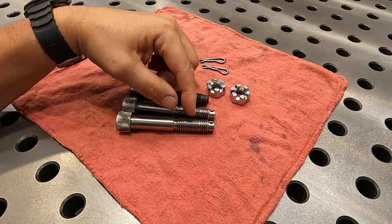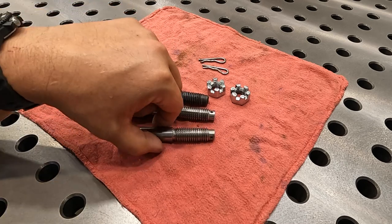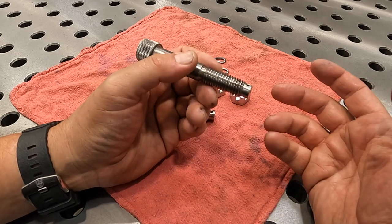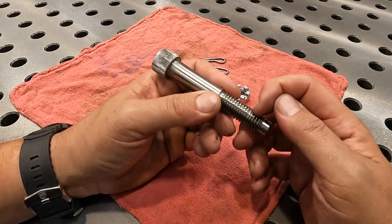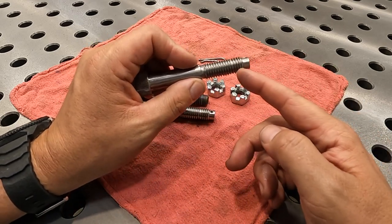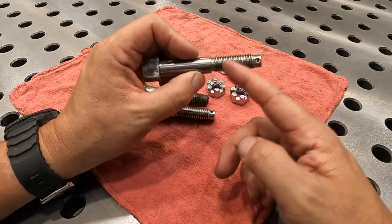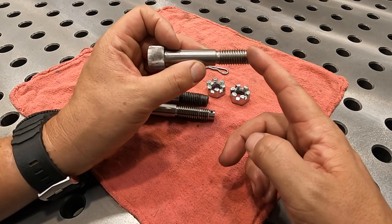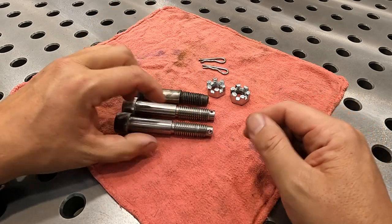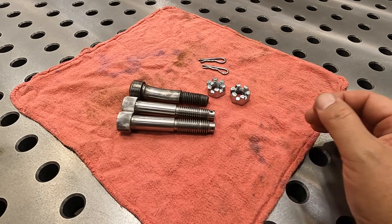It's just something that I've done many times, especially with hydraulic work. We had to do a lot of thread chasing with hydraulic work, where you get a part in, a hydraulic rod or a piston, a tube that has a galled thread, kind of what looks like that right there. You have to be able to come in there and line your tool up on that existing thread to chase it and clean it up. But it works the same for something like this if you need to thread a bolt further up the shank. So anyway, that's it. We got this one done. I'm going to go hand those to Joe and get back on some other projects around here.